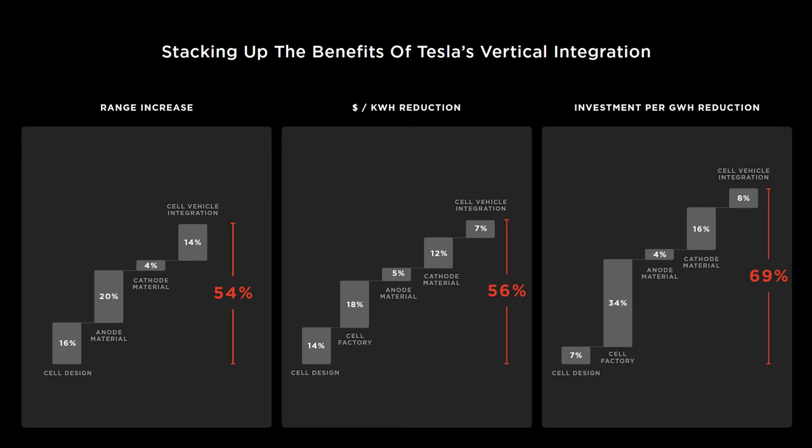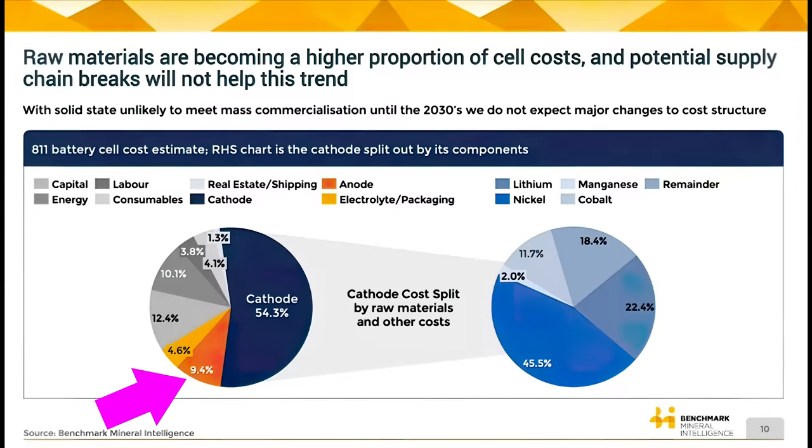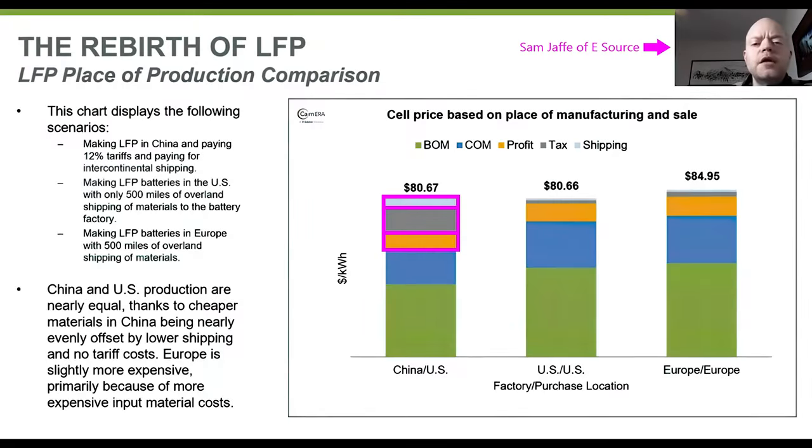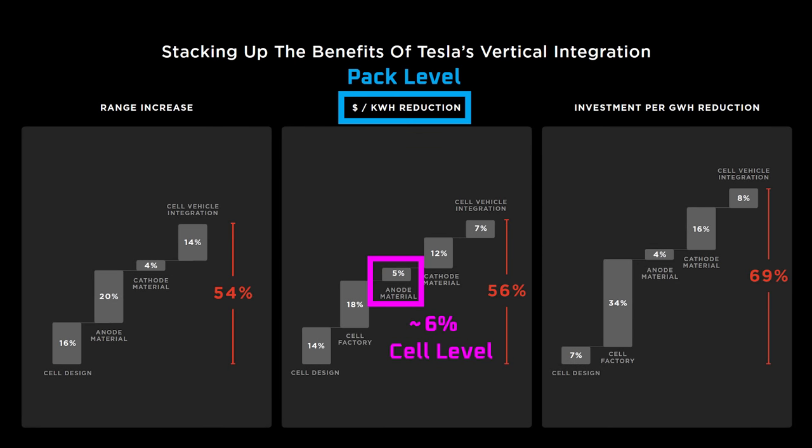What are the implications of a silicon-free graphite anode in terms of cost? On a dollars per kilowatt hour basis, Tesla expects their in-house silicon to save 5% at the pack level, which is about 6% at the cell level. Graphite is already fairly low cost and high energy density, so on a dollars per kilowatt hour basis it's cheap and only makes up 9% of cell cost. A 6% cost savings against a maximum of 9% is good on a relative basis but not earth-shattering. Furthermore, the first iteration of Tesla's silicon will probably save closer to 2% rather than 6% because Tesla won't start with maximum silicon loading. For comparison, Tesla will probably save 10–20% on in-house battery cells just by avoiding third-party premiums, shipping, and taxes. So getting the 4680 line working is a much bigger priority than saving less than 6% at the cell level from Tesla's silicon.